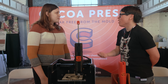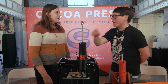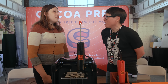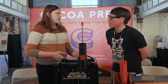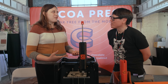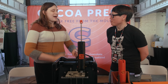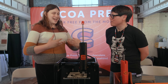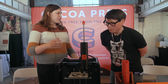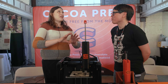We're benefiting from all the advances on the software side — the repository of wonderful print-in-place models, base models, Arachne. I've been working on this for about 10 years. When I started, even auto bed leveling was barely a thing — you were using springs and manual bed leveling. Now you can just throw an inductive probe on there and enable something in Marlin or Klipper and you have it. I love how much 3D printing has changed over the years and how much we've benefited from it.